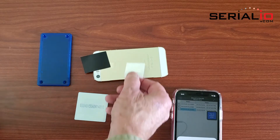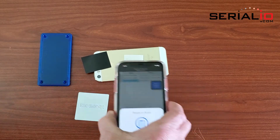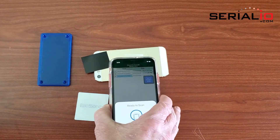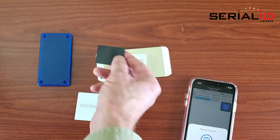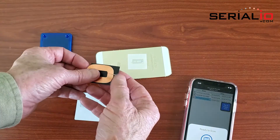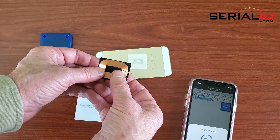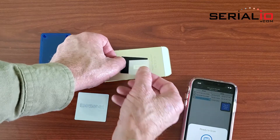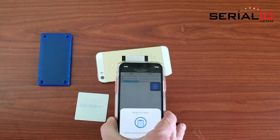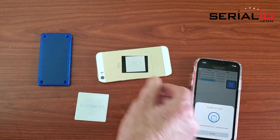It can work on other surfaces as well, but if you try it on metal it can't work because the metal prevents the technology from working. This is a ferrite barrier, which is commonly used in wireless charging applications as backing for the coil. Put this on the metal and then the standard inlay can be read on the metal.